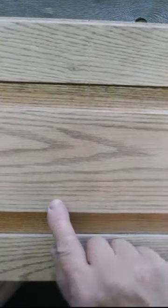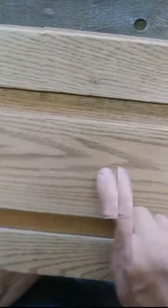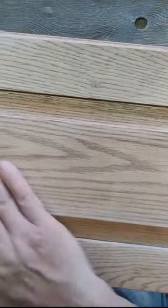Okay, the 320 helps to close up the wood grain and make it smoother. All right, so it takes the black stain better. It won't resist it so much because it's not as coarse. When I get done, it'll be a smoother surface all the way around.